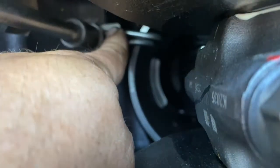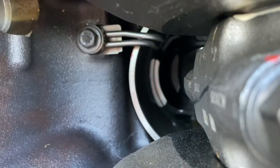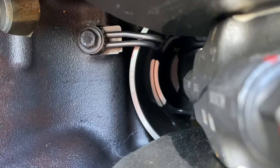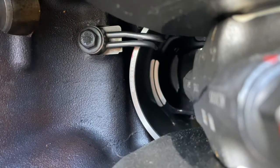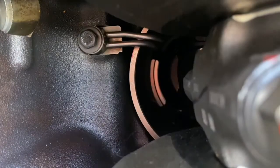You don't want to force these in. You can see now that it's located properly between the two edges, and then you torque the bolts up to 35 Newton meters. I put a bit of thread lubricant on these bolts before I tighten them up.